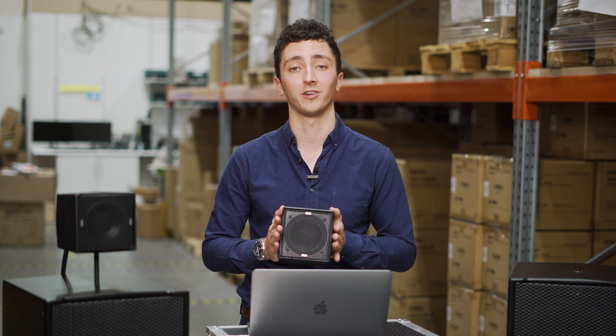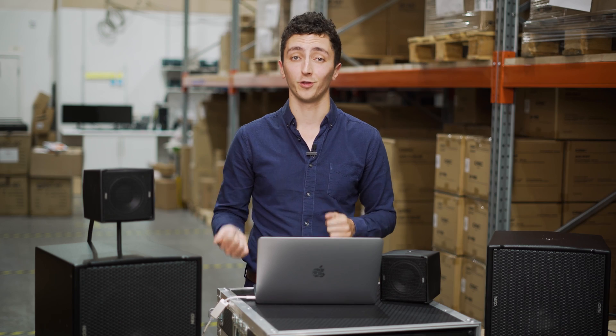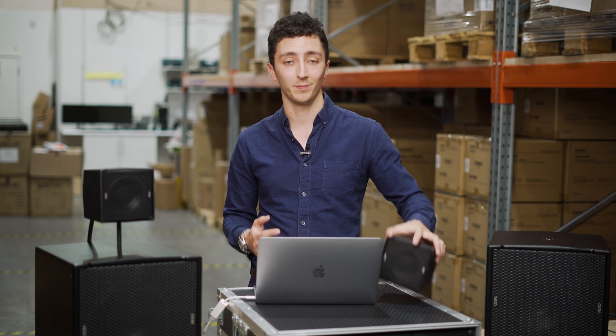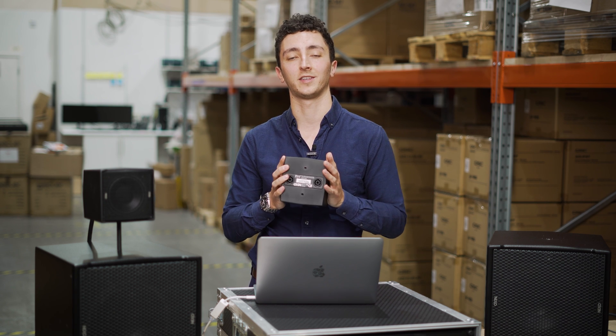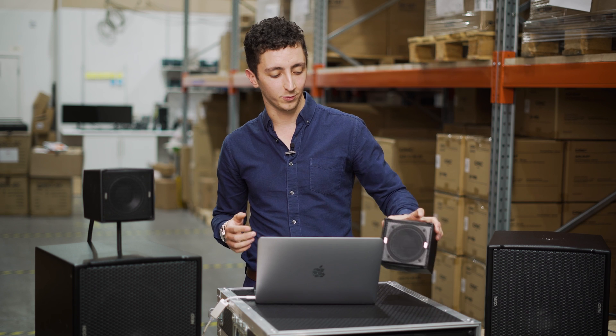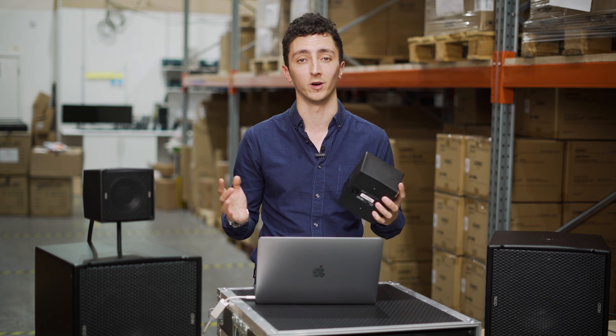For the physical aspects of the cabinet, we've got a four-inch coaxial driver with a 1.3-inch voice coil, and in the subwoofer we've got a long excursion 8-inch with a neodymium driver. Both cabinets come in either an install or a touring variant. I've got the touring ones here today, which have a metal grille on the front — nice and rugged and durable — with Speakon connectors on the back. The install variant has a cloth grille on the front and a cable gland on the back, making it suitable for the install world.